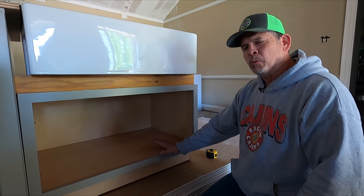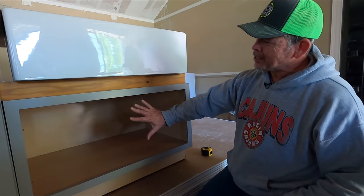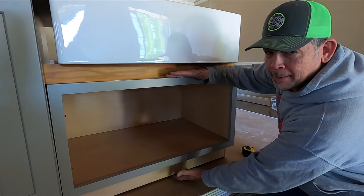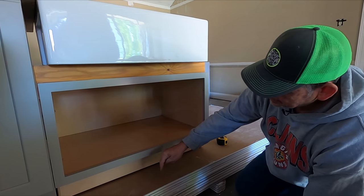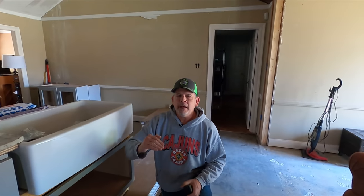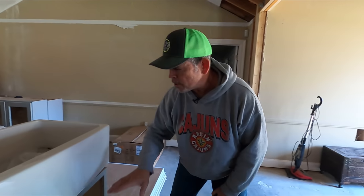On this project we don't have our disposal, but about a year ago we did a video on this exact subject. Jordan and I were watching it today and it was pretty rough. Anyway, this is the same sink base and farm sink height as that video, so we know the middle of our drain is going to be 17 and a half inches from the finish floor. Over on that wall we're at 18 inches — might work, but I'm not comfortable with it. Much easier to have the plumber lower it by a couple inches. Also watch out that your water lines are low enough and not behind the sink. All that to say: we've got to lower that drain by two inches, but those two inches are worth about $800.